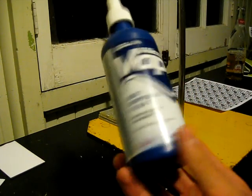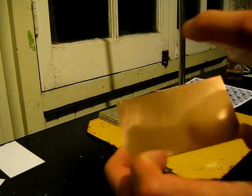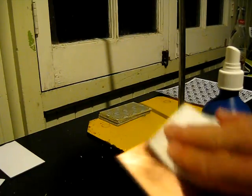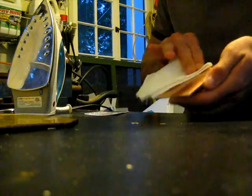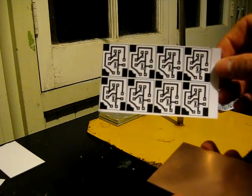I found isopropyl alcohol in a vaporizer bottle. I can take the bottle and go squirt squirt, then polish off — this gets rid of all the copper filings and remaining dirt. Now that the copper is dry, we take our printed diagram and line it up.